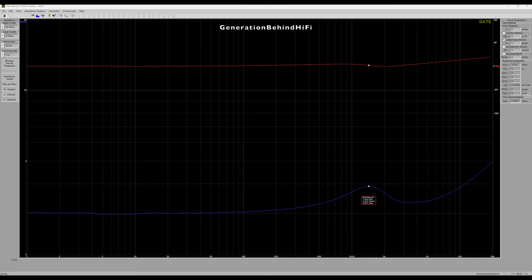They said that the shallower than usual trough above the resonant peak prior to inductive rise appears to be causing this erroneous behavior. If this tweeter had a greater resonant peak provided by greater QMS as well as reduced voice coil inductance, then this error would never happen. He did go on to say that if I created a Zobel network to address the rise in inductance, then I could retrieve the TS parameters from this tweeter, but I didn't have the parts on hand to assemble one. Because of this, these are the only parameters that I was able to retrieve, and from the sounds of it, they might not even be accurate.